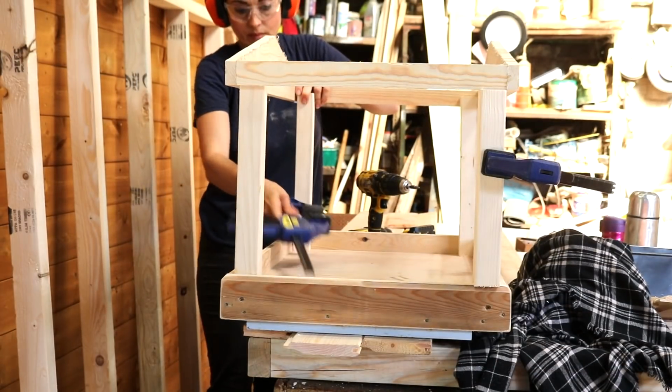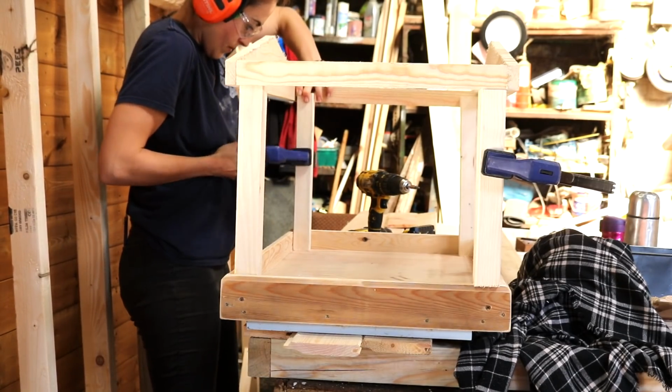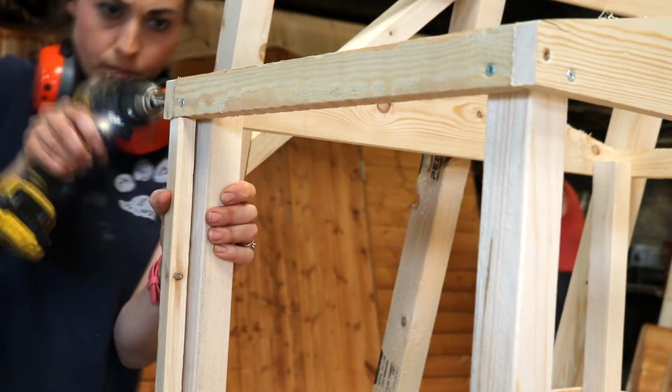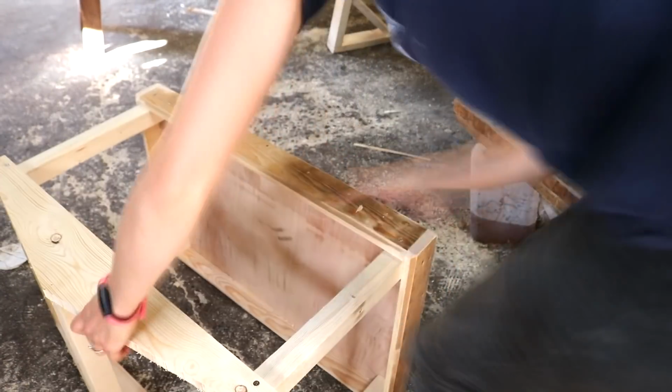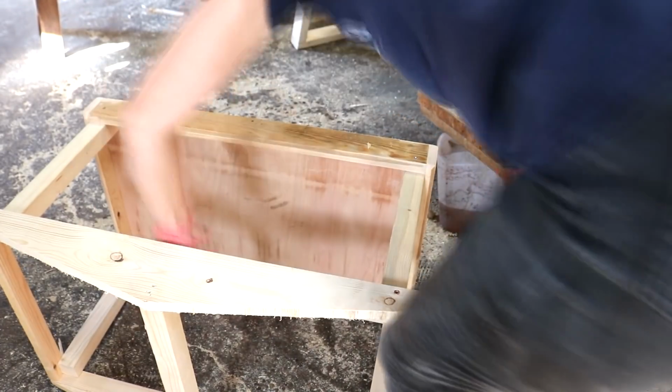After slotting it on top of the corner posts, I'd cut and clamped 4 pieces of wood to the post itself, which would prop it up while I pre-drilled and screwed the top on. To make it more rigid, I also nailed another structural piece in the centre at the top. This would also give me somewhere to nail the roof on and some trim.